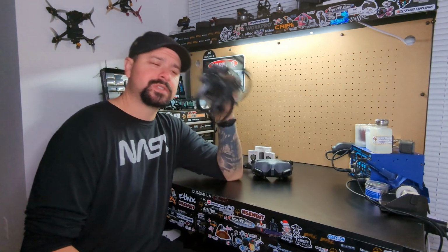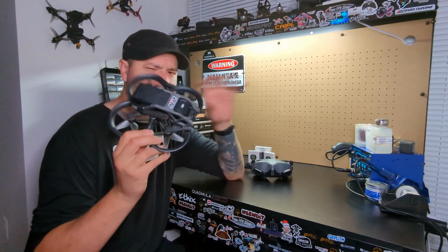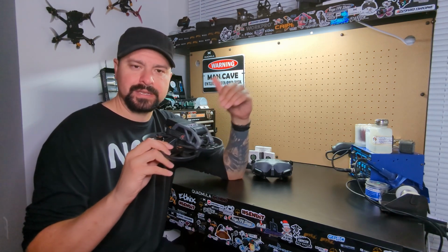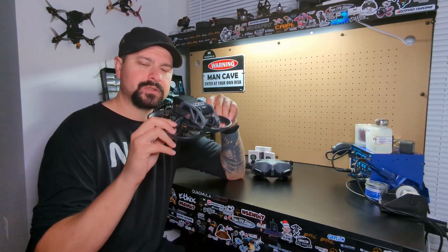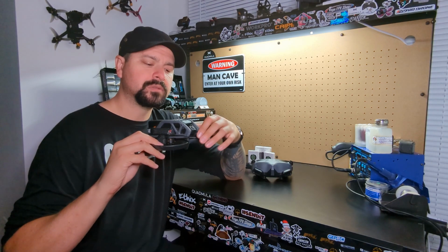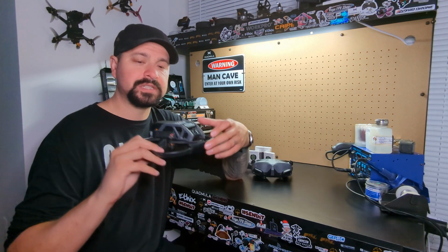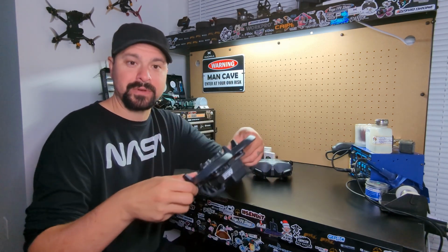Now, regarding the issue with the tree. When you hit a tree or any object for that matter, and the AVATA sort of gets slapped silly for a second, it tends to have that issue where the sensor is in an error mode, and it takes a few seconds to be able to regain its composure. Sometimes I've even seen it to the point where the gimbal will be completely out of whack, and it's almost as though the gimbal is completely up, so when you try to go forward, it essentially pitches the drone completely forward and you almost crash.